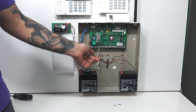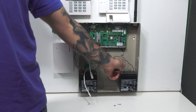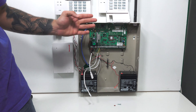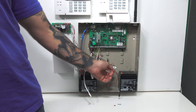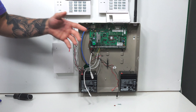To power the VISTA system off 100%, all you're going to have to do is unplug the LT cable barrel connector — that's this guy right here. And then we have to unplug the backup battery. You only need to unplug the hot leg of the backup battery; that will turn it off. And as you can see, our VISTA system is 100% powered down. You can also unplug the neutral leg of the backup battery if you want to, but you really only need the hot leg. With these two items disconnected, the system is 100% powered down and now we can do whatever we need to do.